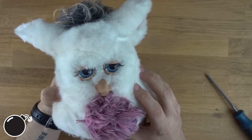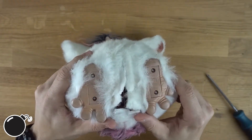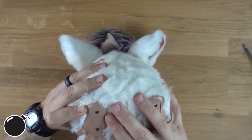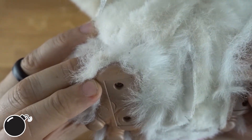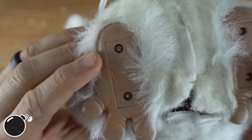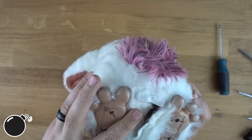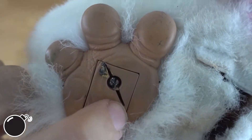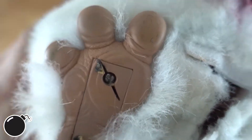First I'll get the skin off and see where it's actually attached. Going in through the bottom — really little trilobe screws. So what I'm gonna have to do is go Dremel these into a slot. As long as you don't care about destroying the product, you just Dremel a slot right across any kind of crazy screw they put in there and then it's a flathead screw.